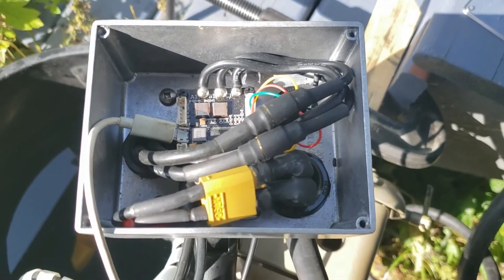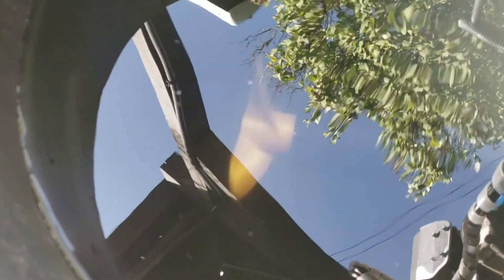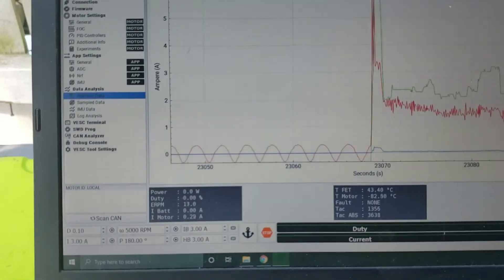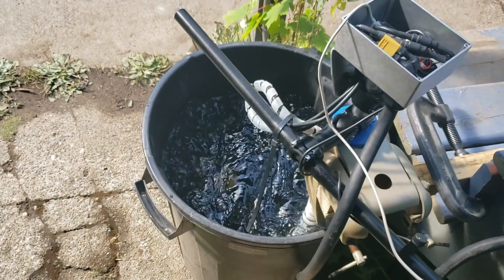The VESC is all wired up and ready to go, controlled with a potentiometer. The prop is in the water — kind of hard to see but it's in there. It took a while to get the slow RPM operation dialed in with VESC. It took a bit of fiddling but I ended up getting it into field-oriented control and it's working pretty nicely. As I turn it on we can monitor the power on the laptop — about 30 watts at low throttle.